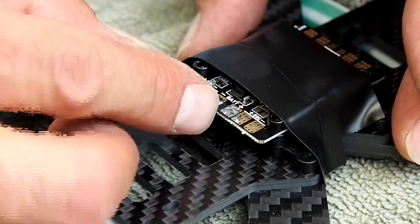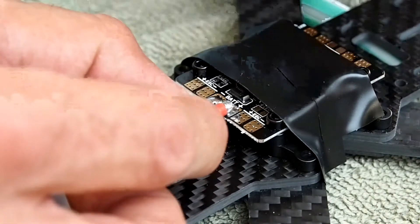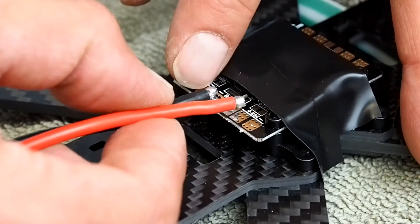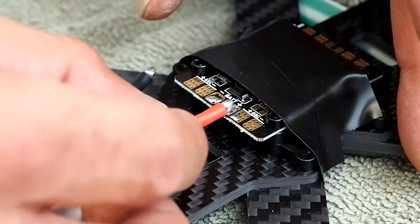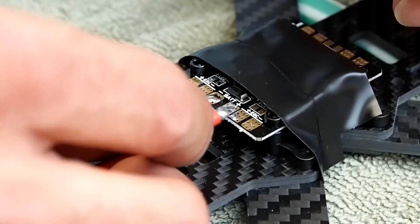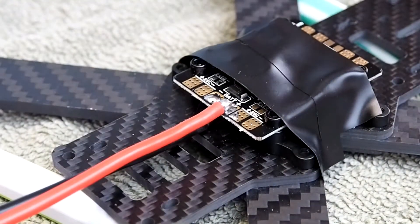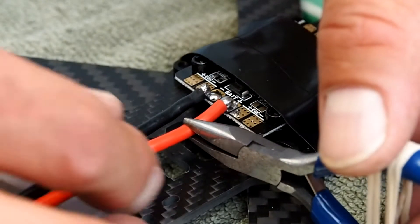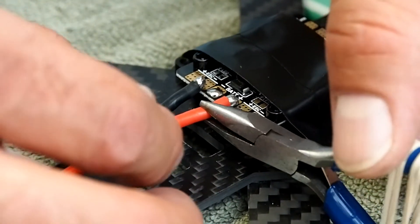Sure is nice and pretty though. We're going to start with that positive because that's going to be the more difficult one, obviously, since I swiped it a lot. Now when you get this wire on, you want it to be stable — it can't move. So we're going to get right on there, and I'm going to use the inside here and touch there so I stay away from that ESC. Now of course when you put the negative, I'm going to have to use the other side. I'm going to use one of my little clamp tools to hold things down.